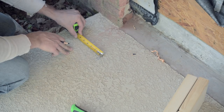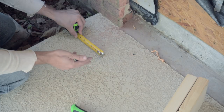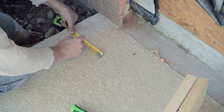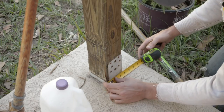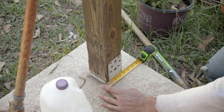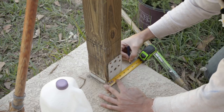From here needs to be six inches. I'm going to use two by six for the base plate of the wall, which is only five and a half inches, but I need to allow for another half inch for the siding — the plywood in this case. So the wood will go to here and then the outside of the wall will go here. On this side we basically have to go six inches because we know the top lines up with the inside of our wall. Two by six goes to five and a half but our actual wall is going to go to six.